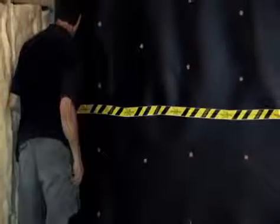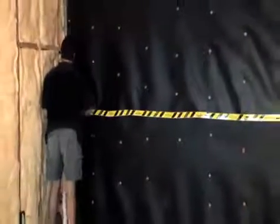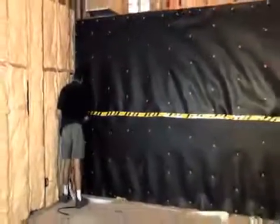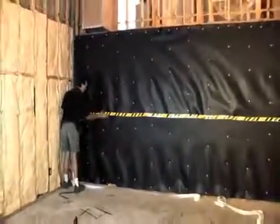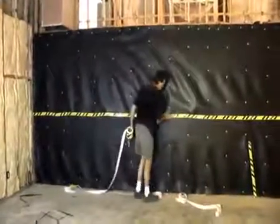On this particular installation, you'll notice we used large pieces. That was due to us having a 4-man crew. If you're using a smaller crew, I would recommend smaller horizontal pieces. You can cut them vertically, seal them in the exact same manner as we've shown you, and you'll achieve the same result.